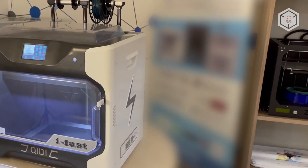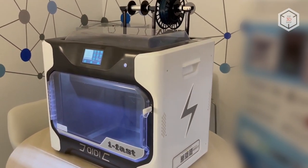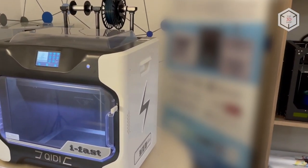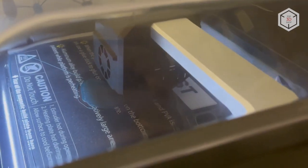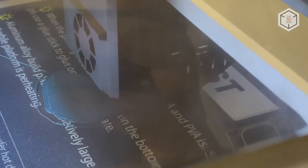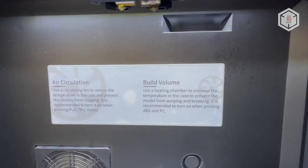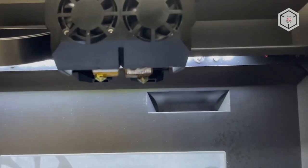One of its main advantages is a single user interface for the entire lineup, which ensures high usability. Another benefit of the machine is the build chamber heating system, which uses a single heating module located on the rear wall. Unlike the CreateBot 3D printers, which share the same price category, QIDI's heating module is less bulky, but it is unable to heat the chamber above 70 degrees. The plastic used for the printer's external panels is vulnerable to high temperatures, and although the body is not tightly sealed, the temperature inside the machine is preserved efficiently during printing. The advantages also include the webcam and Wi-Fi connectivity.